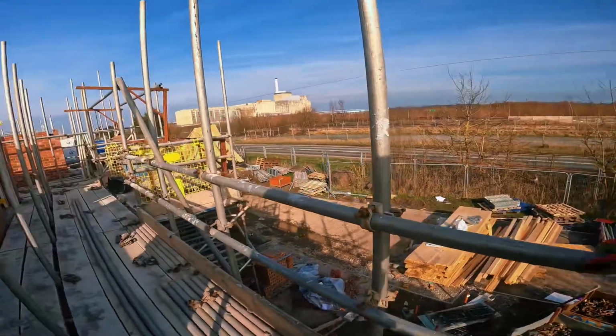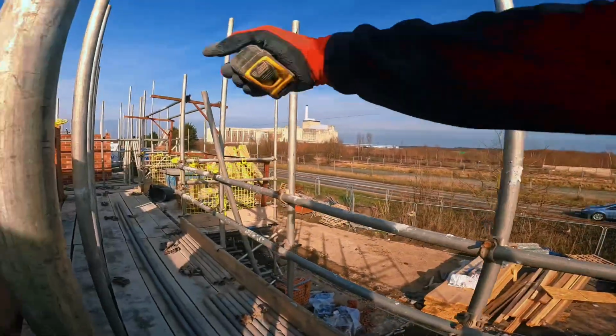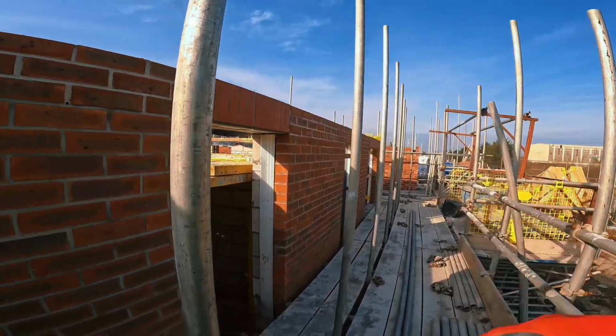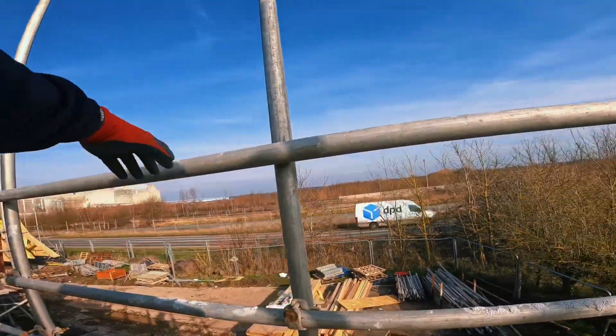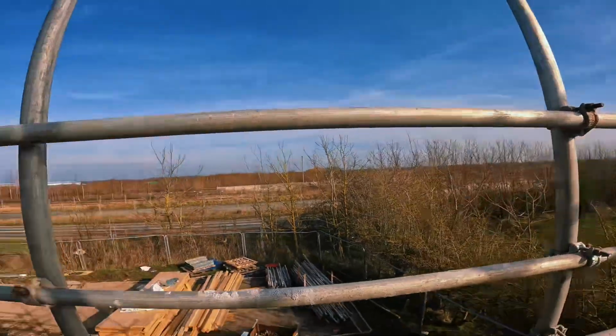Leave the top handrail in again, to be fair, I won't be taking that one out. To install a new one along the top, install the ones above. Set all my ledgers up, brace it all again, single transom each end. And we're good to transom and pull boards up again. Go then. Measured in at 17, installed, checked for level, it was a little bit too high, dropped it a tiny bit this end so it matches there nice and neatly.